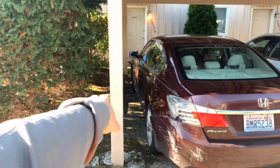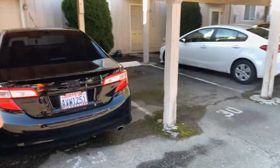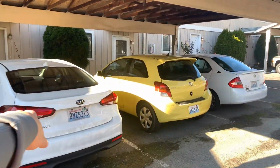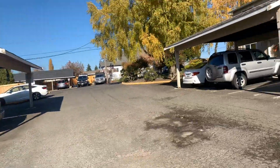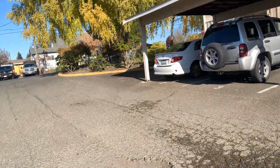Okay, so then as it goes under the carport, you see wheel stops go all the way through, and then we'll do a saw cut. Well, I don't think we'll have to saw cut. Might just be able to grind right in front of it. Either way, we're gonna go right in front of the wheel stops here on both sides. So now we're not removing the wheel stops.